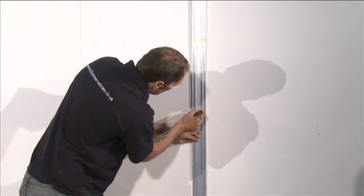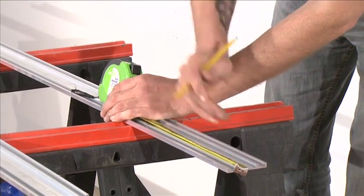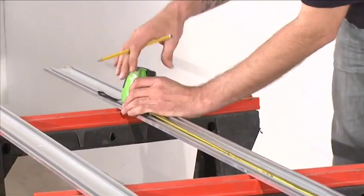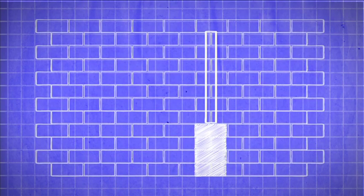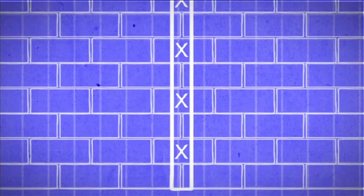Fitting Panels. Locate the wall plate and connectors and mark out the position of the relevant fixing bolts. The first and last 60mm fixing bolt should be positioned 50mm from the top and bottom faces of the wall connector, with the rest being spaced equally between. A total of three fixing bolts are used per wall connector on a dwarf wall model, and five per connector on a full height model. If any of the positions marked for the 60mm fixing bolts land on mortar joints, adjust the position accordingly so that they locate over solid brick.